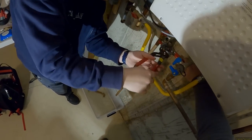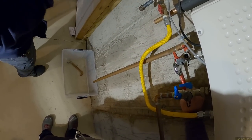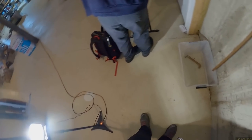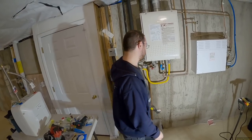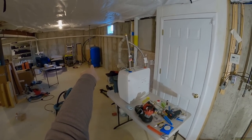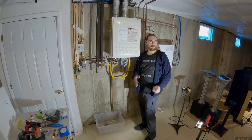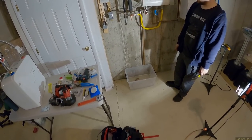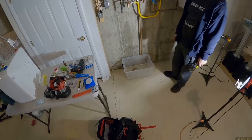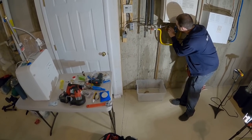Don't drink the hot water — no one should drink the hot water. With even just one extra foot of pipe we have so much water. Where is it even coming from? I have the house main shut off, so whatever's in the pipes is all that's left. The garden hose expands so it acts like a pressure reservoir — that's a hundred feet of hose, it would have been done already. It's actually not that much water total, it's just taking forever to drain out.